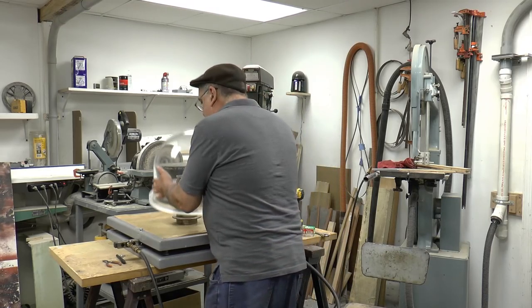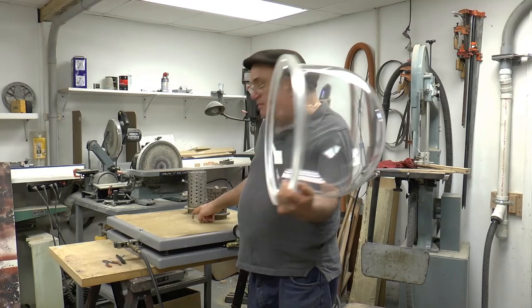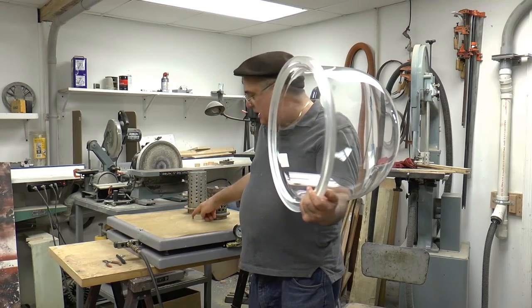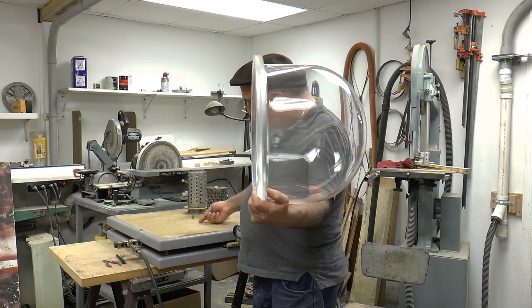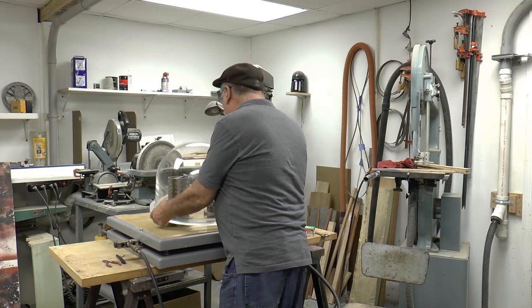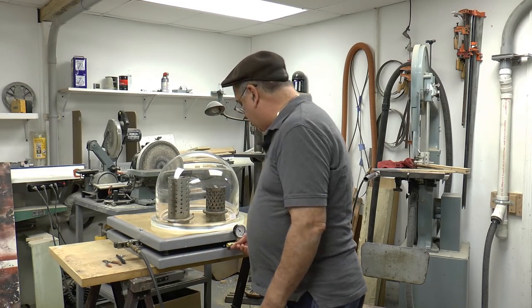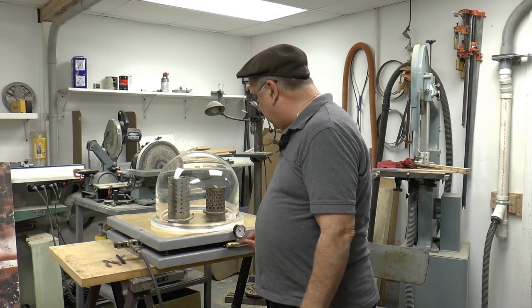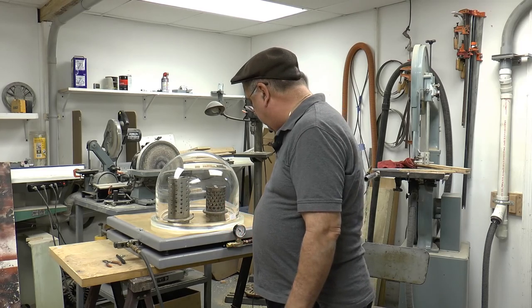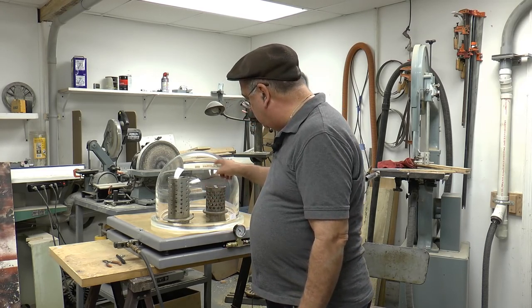In the bottom here — I don't know if you can see it in the picture — there's a copper tubing with a little fitting I made and a hose that connects between here and a three-way valve. So when it's facing this way, it's sucking air from there down to the pump, and when I flip it the other way, it exhausts out.